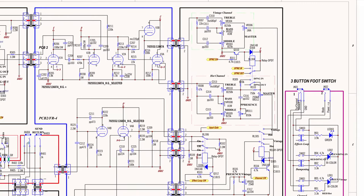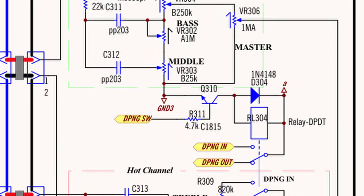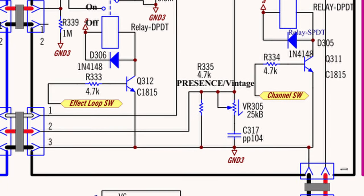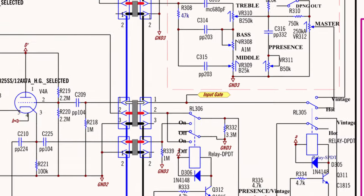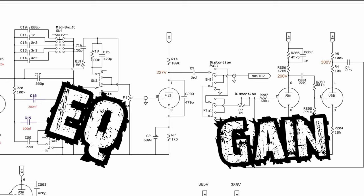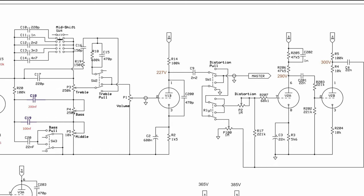With many different other features connected we're not interested in now, the signal goes from there into the EQ stage. And that's where the huge difference is at. Usually amps are built that you EQ after the gain stage to make actual use of the EQ. The Lee Jackson preamp goes from the EQ to the gain stage, so it's flipped to other usual amplifiers.